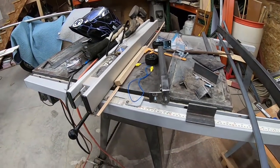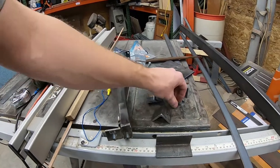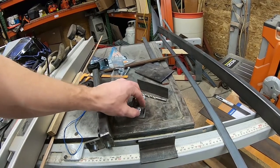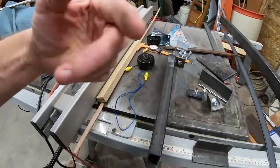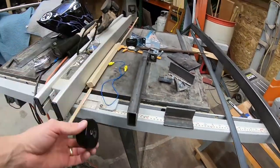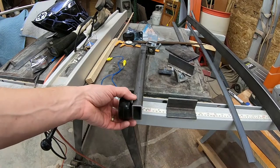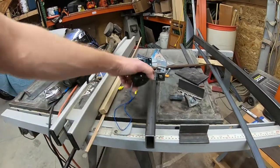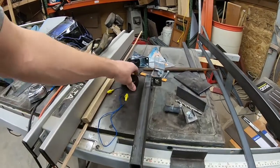And like I said, I thought I'd shoot a video. You can see me assembling and putting the rest of this together. I still need to weld a bolt in the bottom of that one. I'm pretty sure I can make this work. If these aren't long enough, my plan, and I don't have that hardware in here, is that I already picked up some 3-inch bolts to go through here. I'm just going to drill a hole through the bottom of this and mount that wheel there. There'll be one on either side, so that when you pivot it up, it can roll on that wheel. And worst case scenario, if I made these too short, I can easily weld a little extension plate on there to get those wheels down further. But I'll see once I get going.